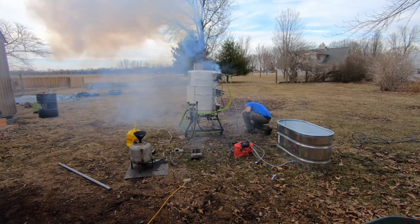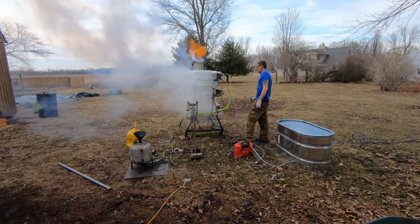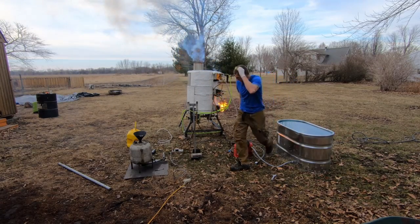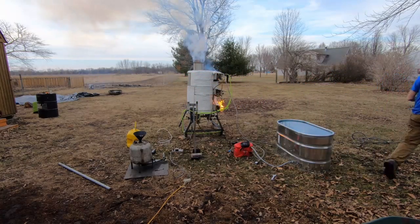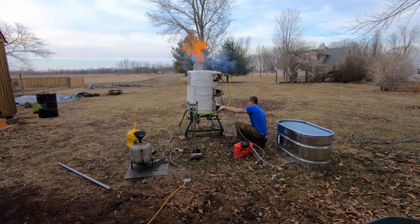Because we're using diesel, there's no real danger of destructive detonation — it's more of a deflagration. And there's explosion number three. Pretty much learning that I don't have enough air to run this machine. There's a bottom burner shooting directly into the bottom of that stack, which is supposed to act as a secondary draft fan — that's why the flames are shooting out like crazy. I've got another burner really cranking heat through there, but I just don't have the air pressure.